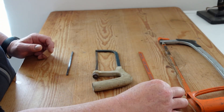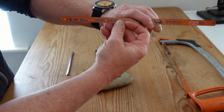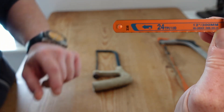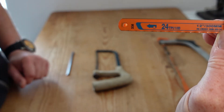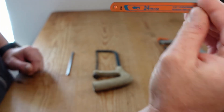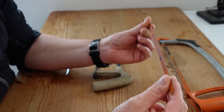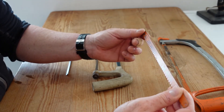I did forget as well to show you that on the front of this blade there's an arrow indicating which direction to orient the blade in — that's important. Because when you're using these blades you cut on the forward stroke and then drag back.